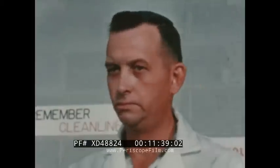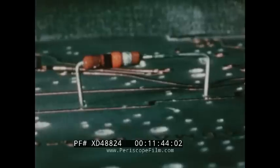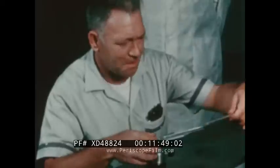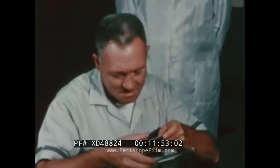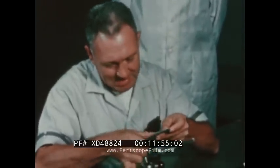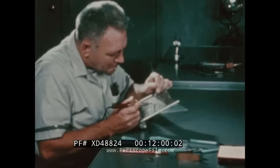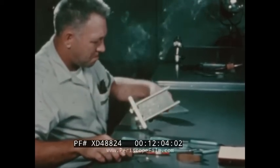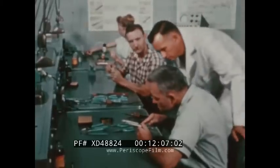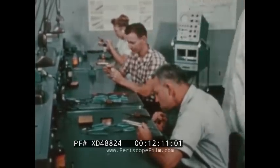See here, the component should be centered between the two pads, not favoring one or the other. Look at all the space he leaves between the component and the board — a basketball player could walk under there with a high hat on. Bend the wires toward the pattern. Too late. Never mind checking the temperature or cleaning your iron — go on your merry way. That does it. You manage to do just about everything wrong. Suppose we let Harry do it the right way.